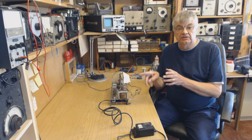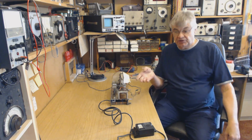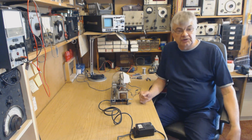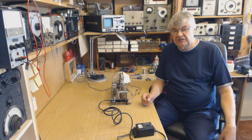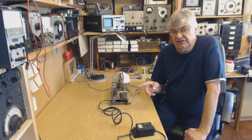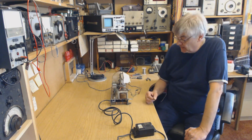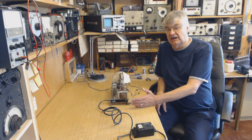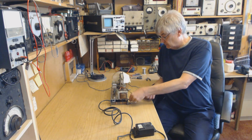the original UL41 obviously had to come out. I put in an EL41 6.3 volt heater audio output valve. The heater current on the EL41 was 6.3 volts at 700 milliamps. That's a lot of current, 700. That's the EL41. Look up the EL42. Same pin connections, smaller valve, heater current 200 milliamps. I'm saving half an amp on heater current by putting in an EL42 instead of an EL41. Plenty of volume. A South Korean company.